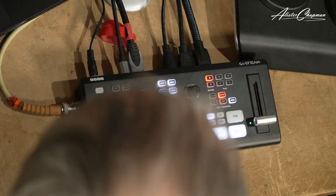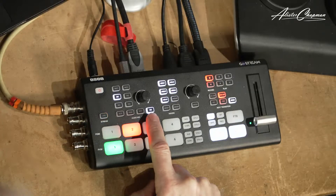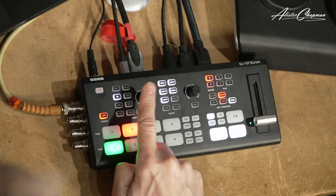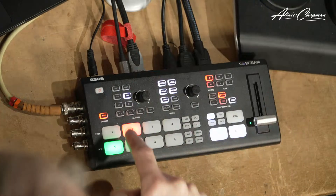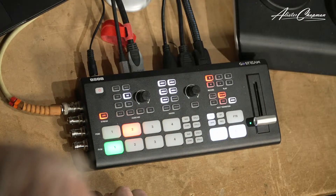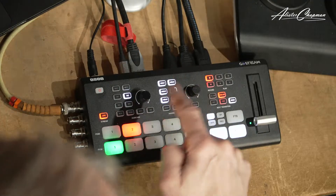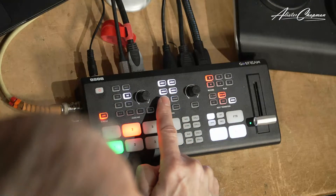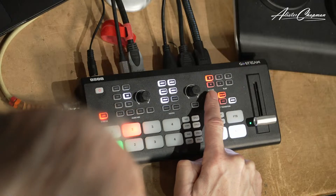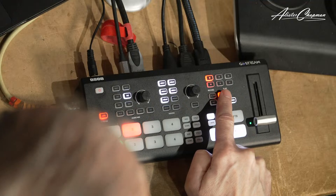Audio-wise: I'm currently taking Audio 1 — if I press the Audio 1 button, you can see Audio 1 is on. I could have Audio Follows Video and various other options, and this becomes an audio level control for Audio 1. If I press Audio 2, there's nothing illuminated — Audio 2 is currently off, but again I could have Audio Follows Video, and this is the volume control. There are memories for eight macros built in, so you can program and recall picture-in-picture effects, chroma key effects, and so on. There's also internal recording to the SD card or to an SSD or memory stick connected via one of the two USB-C slots on the back.